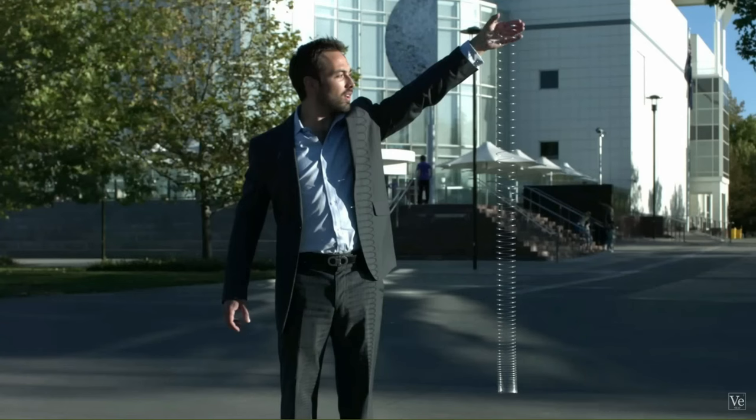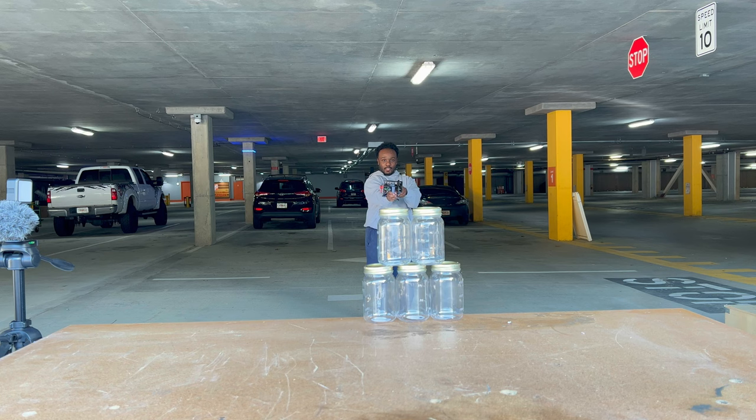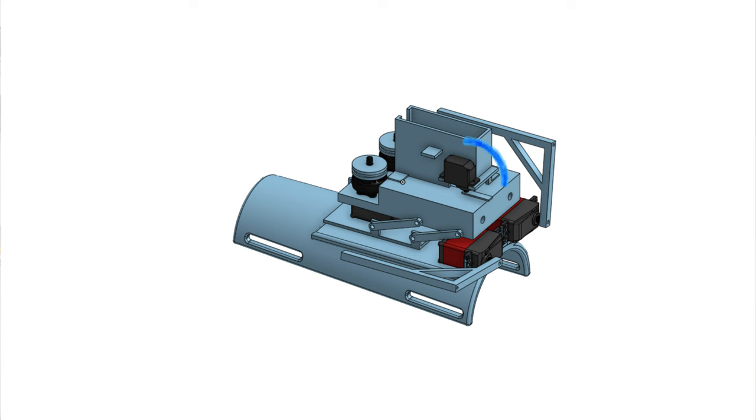We're in a good position with that. The next step is figuring out how we're going to shoot the darts. There are a couple of ways to launch a projectile — you could do it with a spring system or with pneumatics — but I'm going to use electric motors. In the past I used DC motors or drone motors to launch projectiles and it worked beautifully. So we're going to design some flywheels that make contact with the dart, and we'll probably need some type of solenoid system to give the dart the initial push through, and after that we should be good as far as launching the ammo.